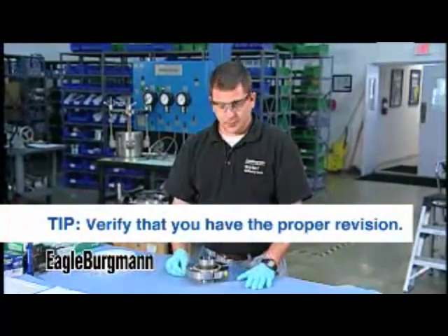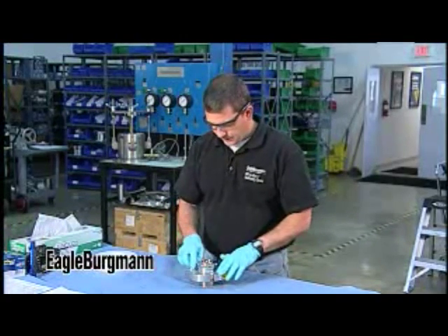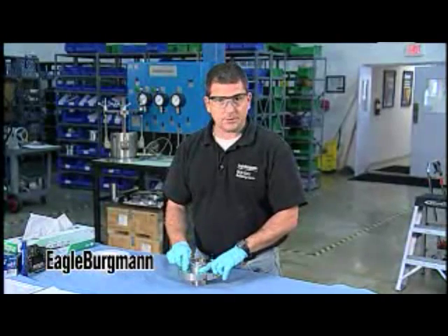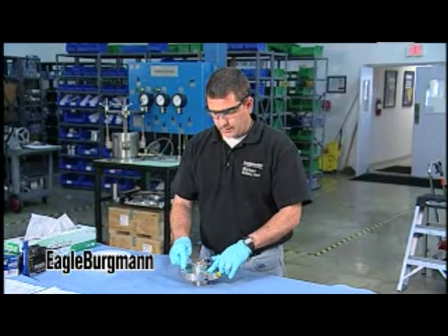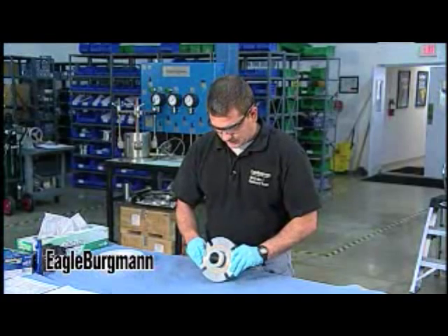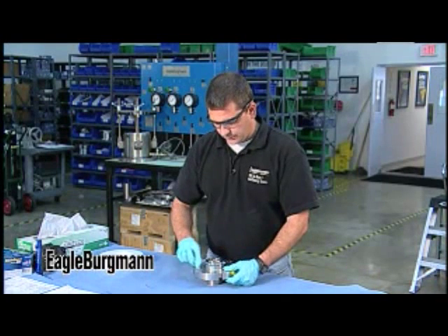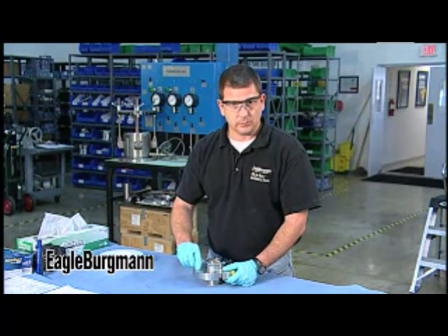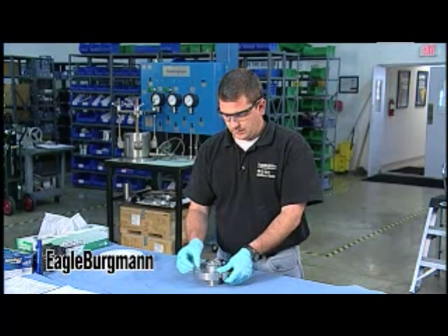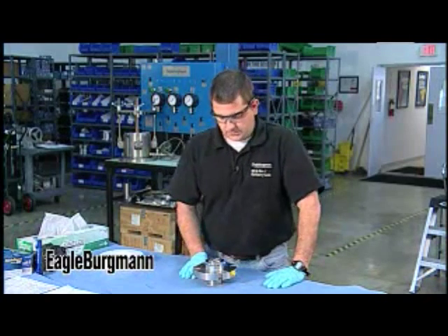A few other things to do before disassembling the seal: where the seal is bolted up, I like to look for witness marks from that bolting. I can usually tell if they used washers, cap screws, or studs and nuts — and whether it's even. For a seal like a Cartex with just a flat gasket, you don't need a lot of compression. What you want to look for is really deep grooves where somebody really torqued down the bolts. That's something you definitely want to record and maybe even photograph, because that's a training opportunity for the customer and it may be related to the failure itself.